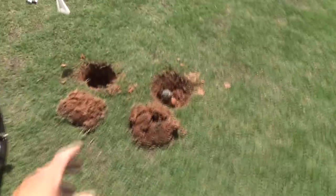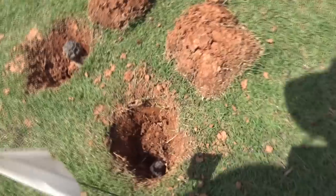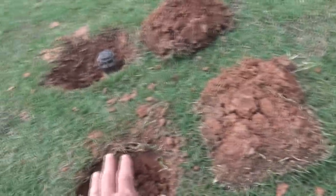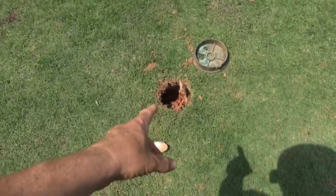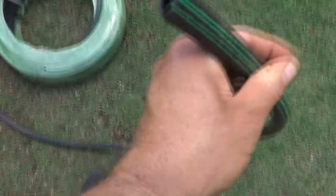So instead of using the clay here to refill these holes, what I'm actually going to do is cut the sod off and fill the hole partway, then put some of that light soil on top so I can shape it and put it back on. You've got a valve sitting here, with main PVC running to this somehow. The funny pipe — let me show you. This is the flexible stuff that they run from the PVC over to the sprinkler head. So you can see he's shoving that little fitting on there — these are called Marlex barbed fittings for funny pipe.